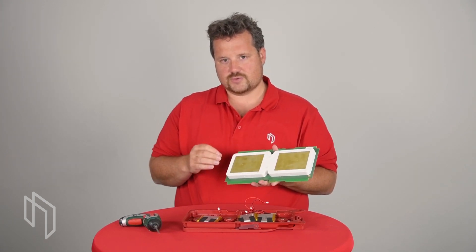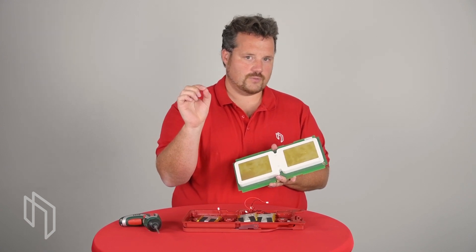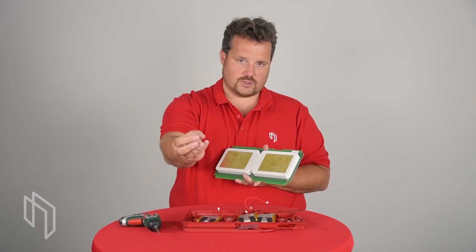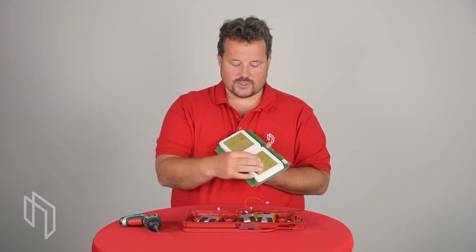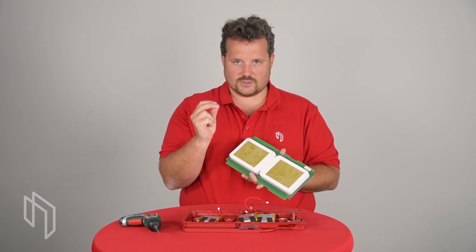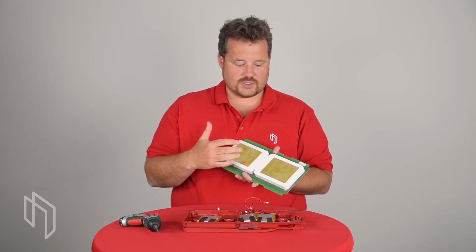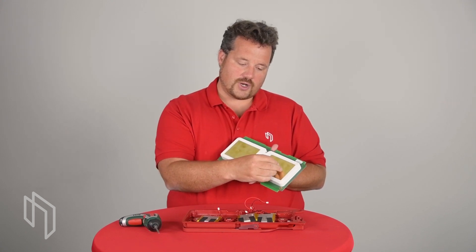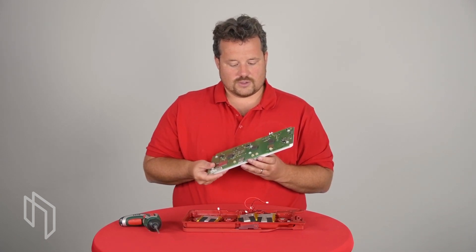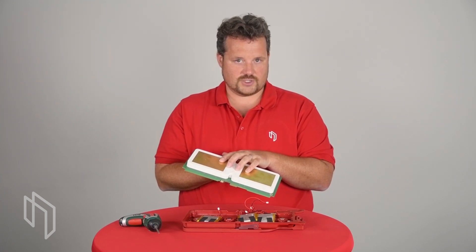One of the crucial parts about RFID readers is that you need to sense a very faint signal coming back from the transponder, while at the same time sending out a very strong signal to deliver enough power to that transponder. So we have one antenna sending out lots of power — it's really loud — and another antenna which needs to hear a very, very faint signal. One issue in a small form factor like this is crosstalk between the antennas, where a small part of the sending signal is picked up by the receiving antenna. Lots of work has gone into the physical arrangement of the antennas to minimize this crosstalk.